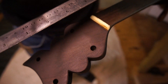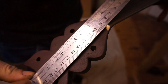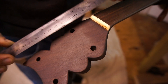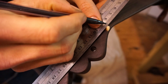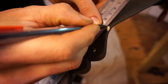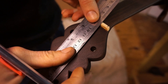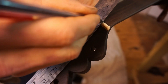You can cut these slots straight back 90 degrees — that's okay and probably how most banjos are made — but the correct way to cut the nut slot is to line each slot up with the hole that the string is going to come out of. I'll even use a ruler to line it up to that hole. I know that's my bass string going to that hole, so I'll mark the nut in that direction. Nobody ever taught me how to do this, so I'm probably messing some stuff up, but it works for me and I've made some instruments this way that turned out really nice.